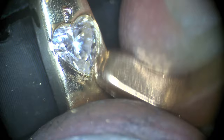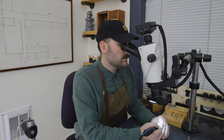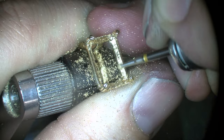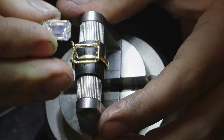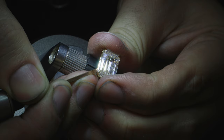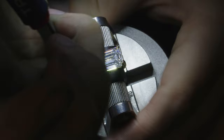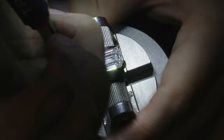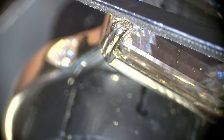Now it's time for the grand finale, the crescendo, the pinnacle, the peak — one diamond to rule them all: the 10 carat emerald. Likewise, I will cut the seats for the corners of the stone and then set it down into place. I'll then use pressure to pull the prongs over the stone, as well as this hammering tool to press the gold down on the corners. Obviously, I could break this stone at this moment, and even though this is the largest lab-grown diamond I've ever set in a ring, the principles remain the same as if I were setting a one carat — so as long as I don't get into my own head, everything's going to be just fine. Once the stone is nice and tight, I want to maintain that really cool claw shape. I will shape the prongs using a small hand file.